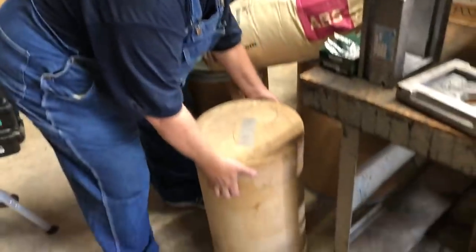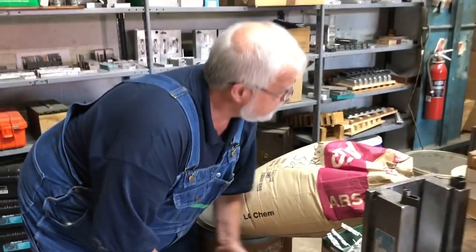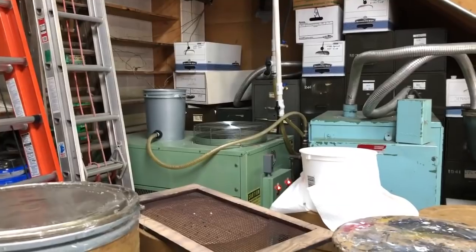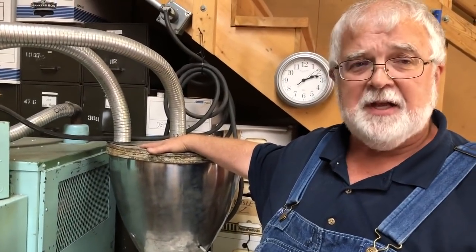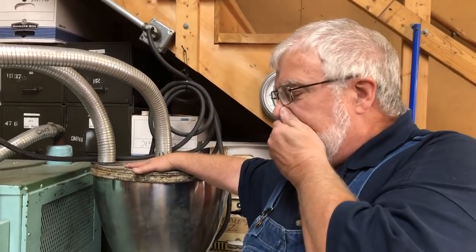Typically we get our plastic in bags or in big barrels and then it looks something like this — it's pellets. Now the noise you hear in the background is air compressors and other machinery that we need to have to make our mold shots. The noise is the green machine that cools the antifreeze we put through the molds. Some plastics require what's called a dryer. Some plastics suck moisture into themselves and when we put it through the machine it creates a lot of steam. We can't have the steam — it makes everything look like an orange peel.